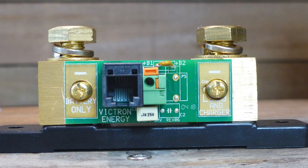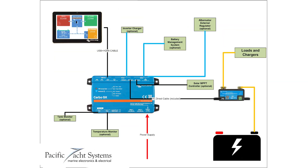Generally this black box is going to be located near your batteries — it doesn't have to be super close, but relatively close — because you're going to want to install a smart shunt definitely close to your batteries. This is your house batteries. A shunt needs to capture all the current going in and out of your batteries. For some of us that's easy to install because the boat's wired like that, but for others it might be a challenge where you need to make sure that this choke point — this one single device, this smart shunt — sees all the current going in and out of the batteries. So it's generally going to be installed between the battery negative terminal on the house and your negative distribution, and that's a way to guarantee that all the current going in, both charging and discharge, is seen by that smart shunt.